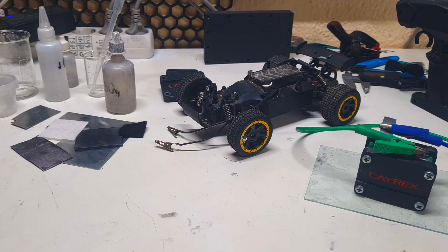The construction of my upgraded version of the zinc-ion hybrid capacitor is fundamentally not so different from a classic zinc-ion hybrid capacitor. On the positive side I still have some carbon-based material, on the negative side I have zinc, and between them is some sort of electrolyte. Sadly I cannot tell you all the details and all the materials I use in this upgraded version.